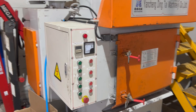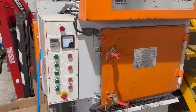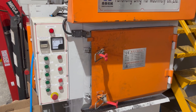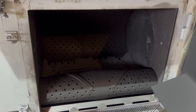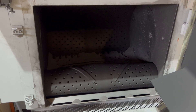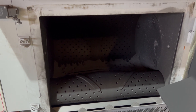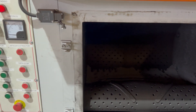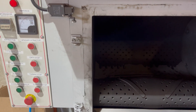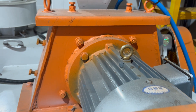This machine fires steel shot at the pieces you want to clean up. It works with a conveyor belt system — it lifts the abrasive media with little buckets up to the top of the machine, then it drops down into a spinning turbine, and this turbine fires the steel shot at the components tumbling on the belt. There's the turbine — you can see it now.